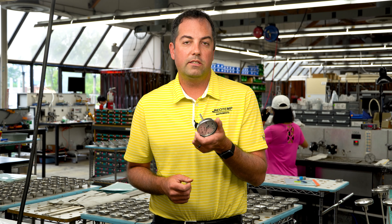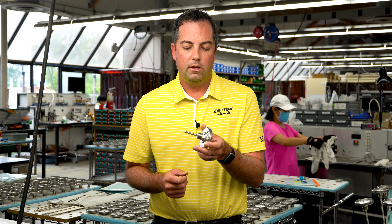So could we build this as a two inch stem? Sure. The thermometer will still function properly, but it might read a little bit low. So if accuracy isn't a critical concern, this could be made a little bit shorter.